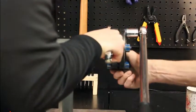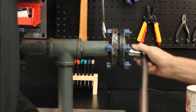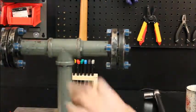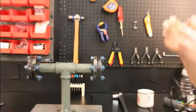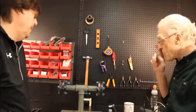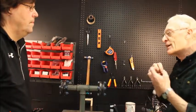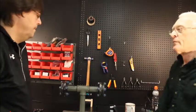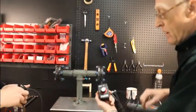You can see the travel there — you're starting to see it. Immediately there's a big difference, and this is all mechanical. The gasket's job is to fill the imperfections in the surface of the flange and to seal. That's what the Top Chem does — as mentioned earlier, the filler densified at the center allows the soft Teflon material on either side to fill those voids. So we're going to set these to 100 foot-pounds.